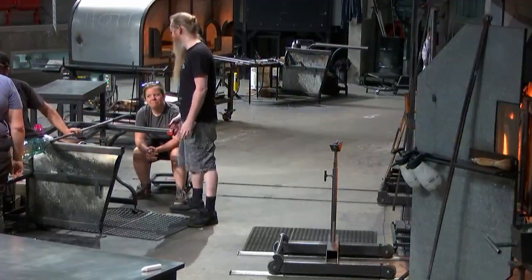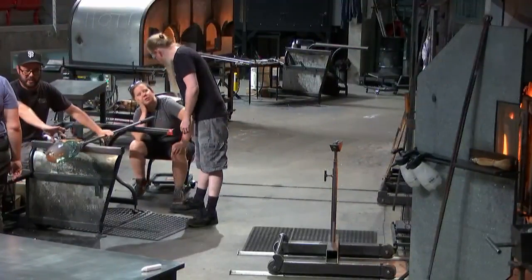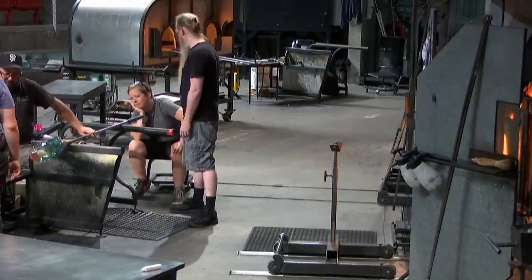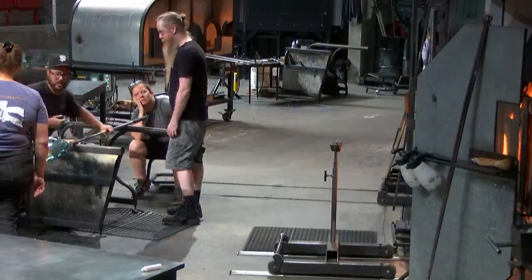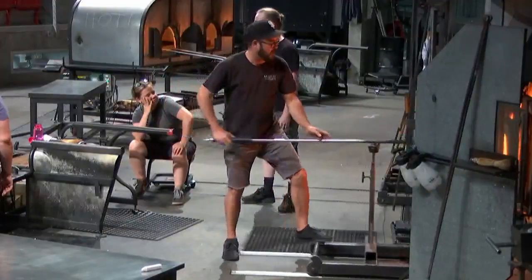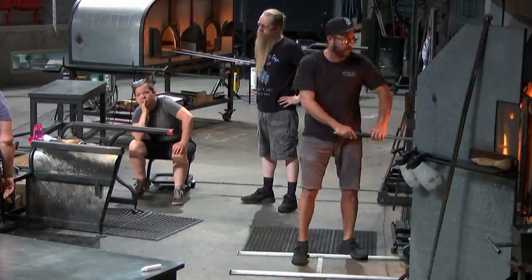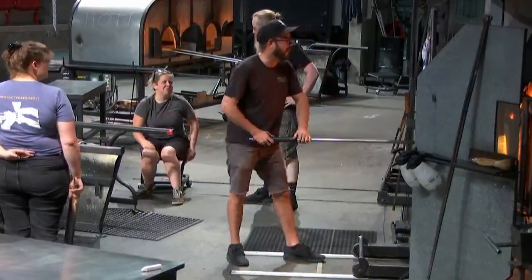The way that the company makes the color itself is by adding different metals of the periodic table of elements. Different metals will produce a different color, like this red that we see here. Red is more of the expensive color, red and pink specifically, because they contain gold. So we add gold to create those colors. To make green, we might add chromium or iron. Blue will be cobalt. Manganese can produce purple and black. And again, it's specifically metals. We even use uranium in glass, which produces a glow-in-the-dark green.